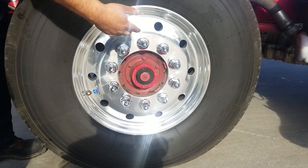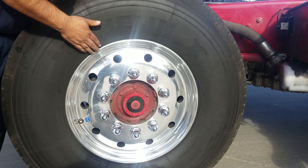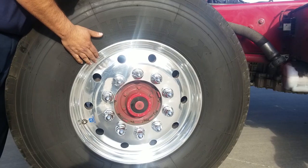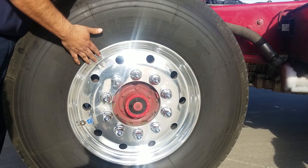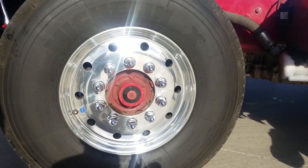Check for other surface damage — did it hit a curb? Is the lip bent over a lot? There is an allowable amount of damage to the lip but it's very minimal. The biggest reason for that is these commercial truck tires do not have a safety bead, so significant damage to the rim can cause a tire failure — the tire can actually come off the bead. You'll get a deflection that creates a tension spot, and under normal driving that can flex the tire enough to let air pass out, and the tire will lose all its pressure.